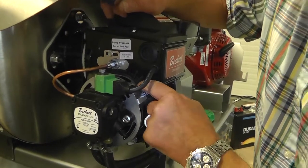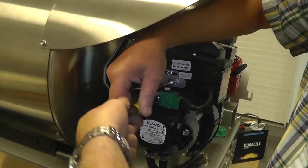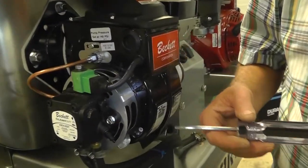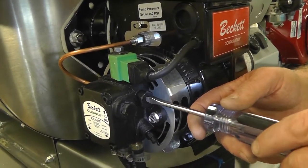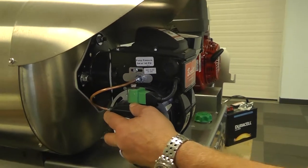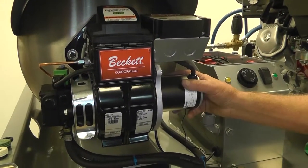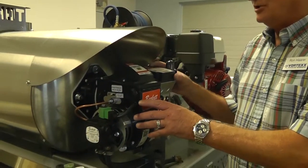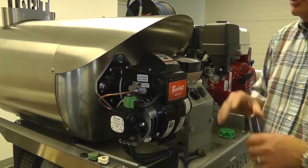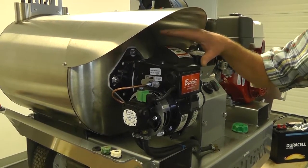So make sure it's set at 10 and 5, then tighten this screw up. If you want to change the fuel pressure, you can do that by going through the manual — you loosen this screw right here and turn it, and that will change the pressure on the fuel pump. This is where you would go through and replace the fuel pump, the solenoid, and this is your motor. Those replacement parts are all in your manual, which walks through all the backup systems and all the ways to keep your burner up to date by changing your nozzles, pressure, flow, or air for different elevations. Normally it's just set and will run very well.